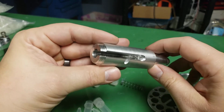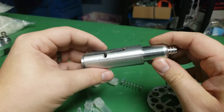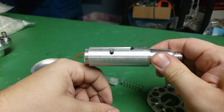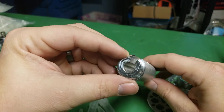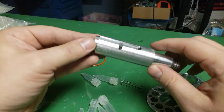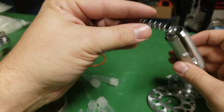And it's a very subtle difference, but what that does is it means you could make this without the need of a rotary axis. You could just hold this in a vise to do that, which is why I wanted to test that idea out. I figured if anybody was duplicating it, they might not have access to a rotary attachment. And then these are just some springs.